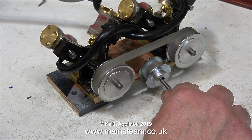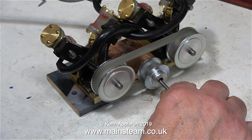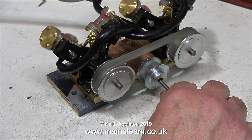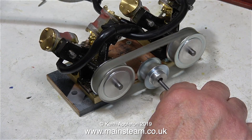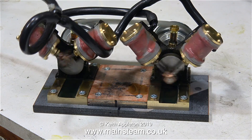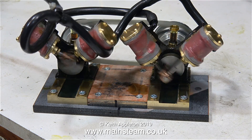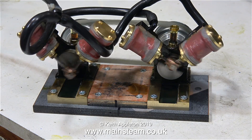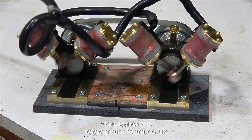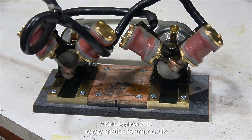This is a smaller pulley from the second set I bought. This centre pulley, once I fit the shaft to it, is going to be the main power take-off to drive a propeller or similar. The bearing for this pulley needs to be substantial, so I'm going to make a special bearing fitting that will be mounted on the centre part of the baseboard. This is not the final baseboard — it's just a quick mock-up to make the engine run.